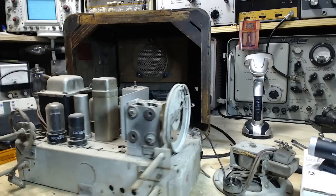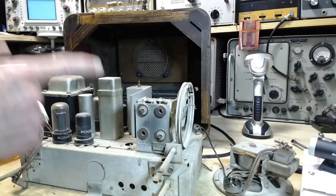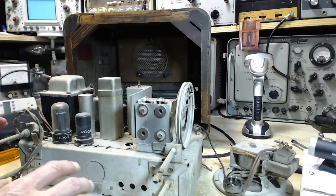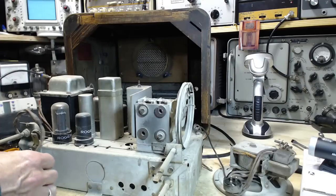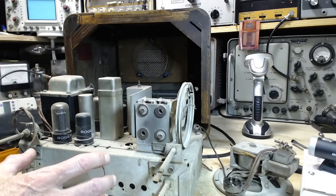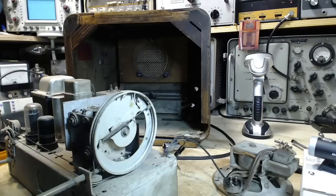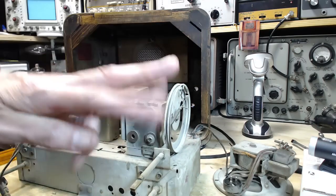Wow, you can see that this radio has a challenge that comes with this style of radio, and that is the pointer cannot be pointing at the dial while the chassis is out of the radio. So that might be a hint on what adjustments they've made available with the radio completely installed. That's probably oscillator adjustments, which control the position of the pointer. That's one way to look at it. That's probably what they've done in this case. And maybe the hint I could have picked up on was if there are some adjustments. Well, let's see, the two holes in the bottom of the cabinet are going for these two IF adjustments. That's not the oscillator. And there's a couple more on the back here. My guess is these will be access to the oscillator adjustments back here. Should be three adjustments for a three-band radio.